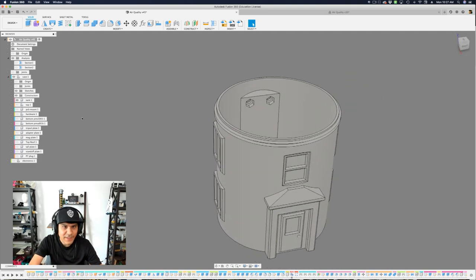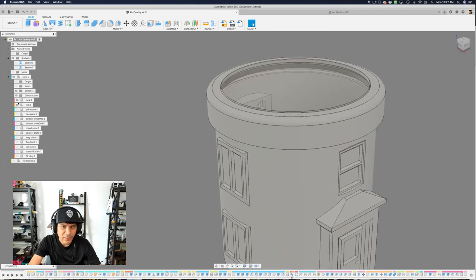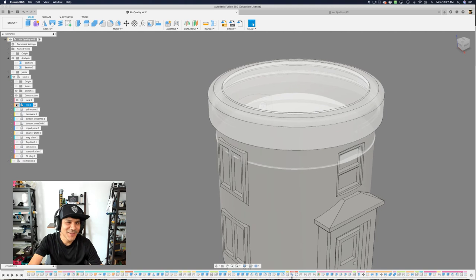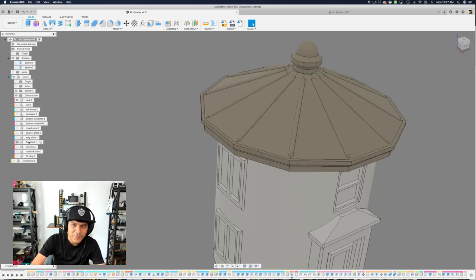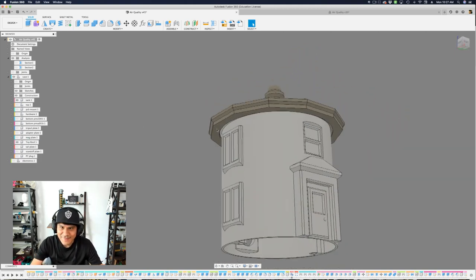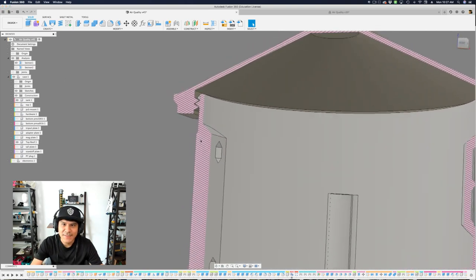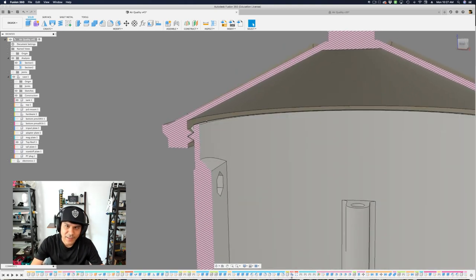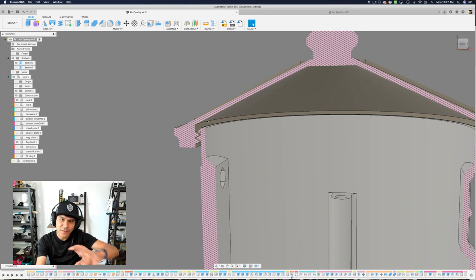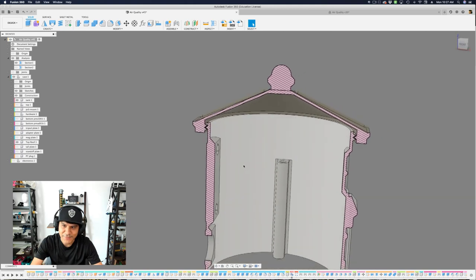We still have the same screw thread top, but instead of a basic top, I designed a new one to really look like a roof — cleverly named 'top roof.' It's got 10 edges and the same threads. What's cool is I ended up 3D printing an O-ring in NinjaFlex, so I can create a nice seal. When I screw the roof on, it really grips that O-ring and creates a nice seal so no moisture gets in from the top. That worked out really well.